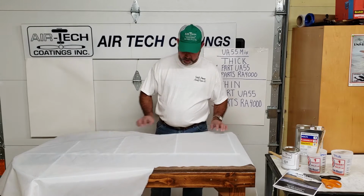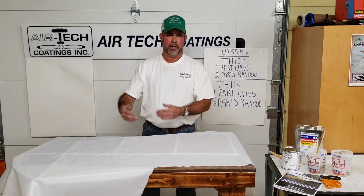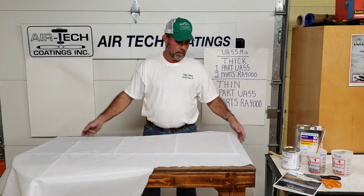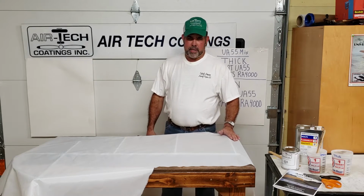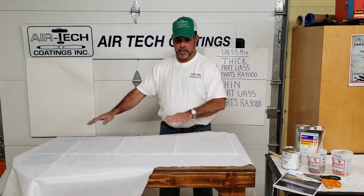There's nothing worse than thinking you've got an inch around here, and you've spent all this time putting it on, and you've moved the fabric, and you come to the end, and it's an inch too short. Got to tear it off because you don't have enough. Now you've wasted that much fabric, and you got to do it over. In the long run, it's just not much difference. You may vary 4 yards, 5 yards in a total rebuild on just giving yourself some extra room.